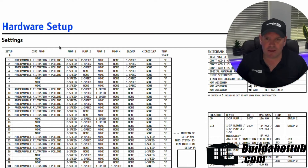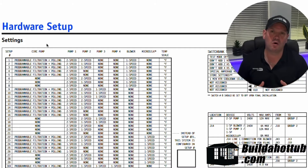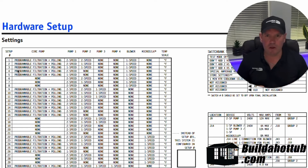So how do we do that? Well, it really depends on the type of topside control that you've actually got, and also the brand that you're working with. So with the Balboas, it might be a key press combination — and I've actually got a video on my channel about that, I'll put a link underneath this video. But also, if it's a Gecko for example, this all this setup is done in the low level programming, which is basically done on the topside control. So it really depends on the different model, but again it will tell you in the manual.